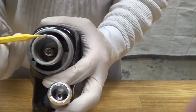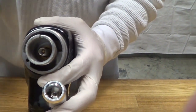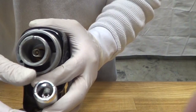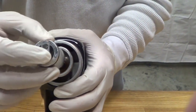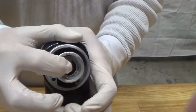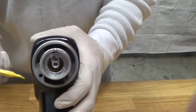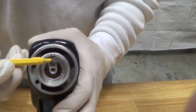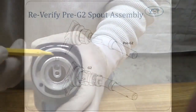Now insert the fuel chamber into the nozzle casting. The poppet stem with the spring goes through the poppet hole in the fuel chamber, the center hole. Once the fuel chamber is resting in the nozzle casting, push the fuel chamber in until it's flush with the casting. The vacuum sensing tube in the fuel chamber should be oriented at the top.